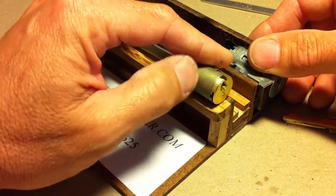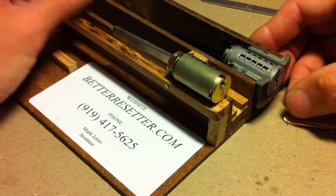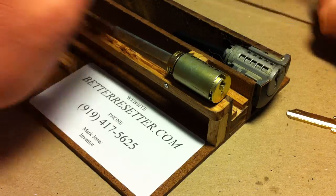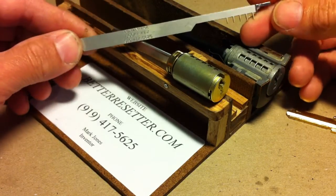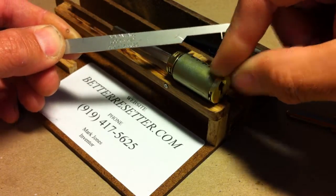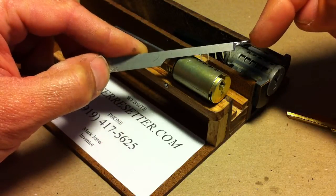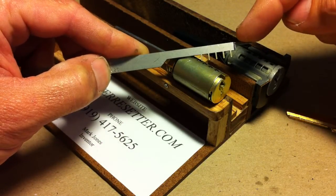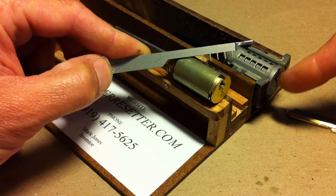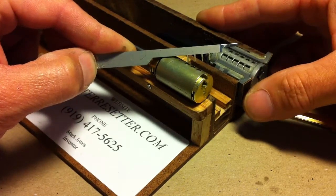So when you see those cylinder attributes, you know what you're working with and you know you will be unable to repin the lock with traditional pin tumbler technology. To reset the Kwikset design, you're going to want to use the proper end of the tool — the Kwikset end is the one with the barb, which is used to depress the change slide through the face of the plug.